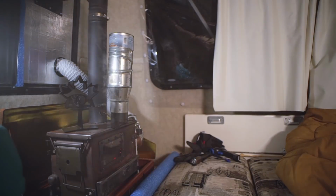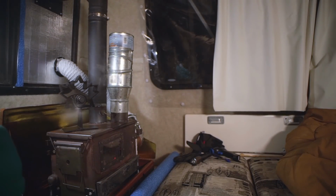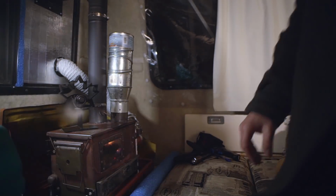As I see it, the hot air rising and the wind deflecting off the vent cover made a negative pressure around the stove, causing the outside air from the flue and the inlet to try to fill the void. The path of least resistance was the hopper. Okay. So my point being, it might seem like a friendly fire, but in an instant, it can fill up with smoke. So please be careful, and don't do anything stupid like I just did.